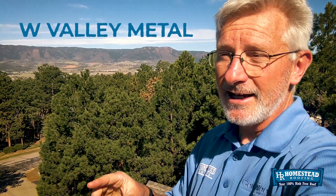So that's why I don't like rolled valley metal. I'm not opposed to putting metal in the valley — if you're going to use the W valley, then that's fine. But a better solution, in my opinion, is to avoid putting metal in it and put ice and water shield down in it. If you want to use metal, use the W valley metal that conforms to the contour of the valley.